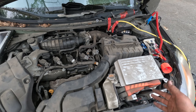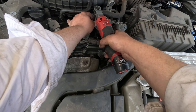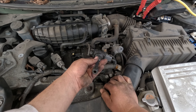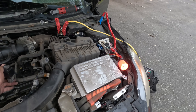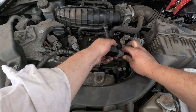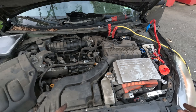The fan turned off and I probably have communication now. Let me swap these coil connectors to confirm it's the coil itself and not a wiring problem. I plug this connector into the second coil position - short's back. So it's definitely this specific coil that's shorted. Let me remove it and plug everything else back in. No short.